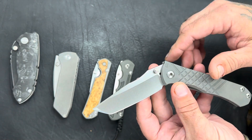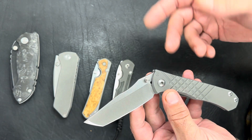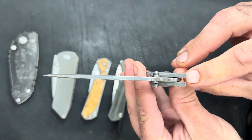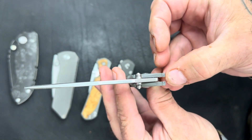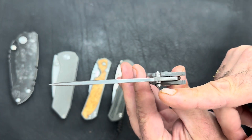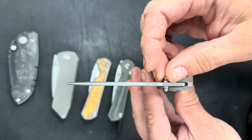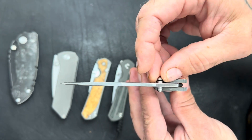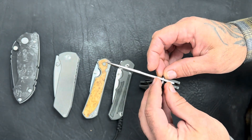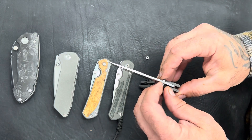Talking with him, it sounded like there was a definite taper in this pin. If you look right here where it's hitting, you can see the little witness marks on both sides where the pin's making contact. Because of the way the O-ring groove was — and the little bell at the top — that part was never even hitting the titanium frame. So I thought a better idea, rather than replacing the whole stud, was to tap it and then make some thumb studs for it.